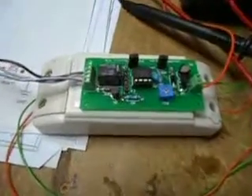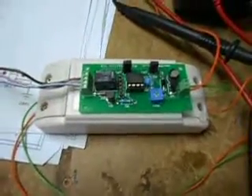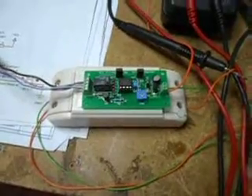We've now managed to get the HCH1 PWM fan driver assembled and I've got some basic software running. The software just overrides the fan when the charger is plugged in and allows you to adjust the speed based on the current consumption. Because the power supply is rated at 1.5A, I've allowed the current to be adjusted between 0.5A and 1.4A, just to give a little bit of headroom for the supply so we're not running it completely flat out.